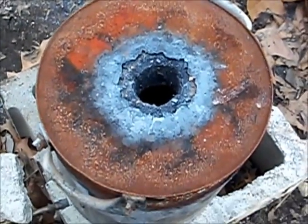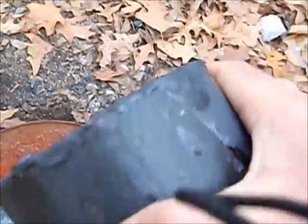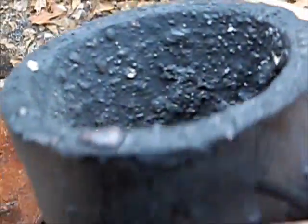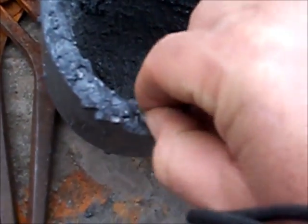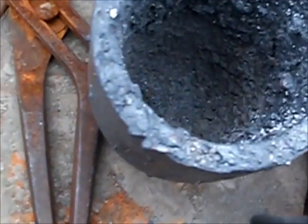I don't really have anything melted that I can show, but I've been casting copper. You can see the little globs of copper that stick in the slag. I'll put my slag in here — there's a lot of slag in there. I clean this up before I use it; I usually scratch that thing out. I've got some tools and I'll scrape all this stuff off, pitch it back in there, and remelt it — all the little globs of metal.